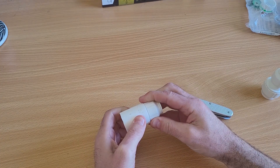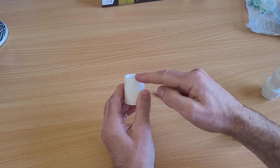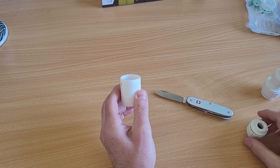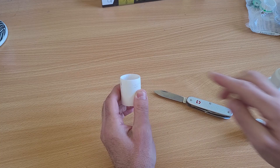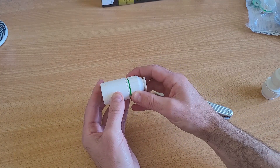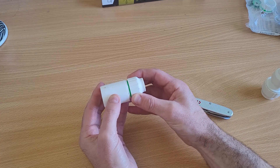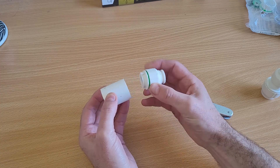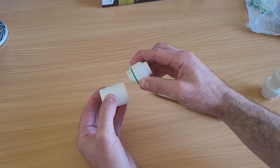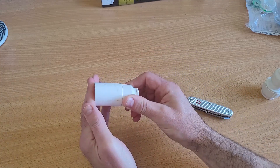That now fits in there no bother. I also made sure to take the end piece of the piping, because that way I've got a nice squared-off end. If you look at this when I put the pen part there, you can see it's not a very nice cut — you can't guarantee a squared-off end and you may get angles. Using the end piece guarantees you get a nice squared-off fitting.